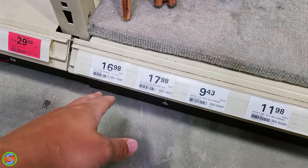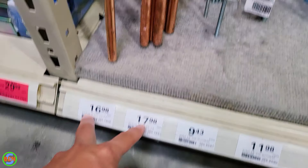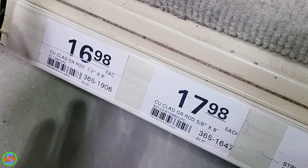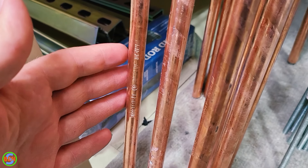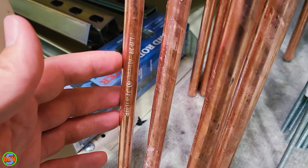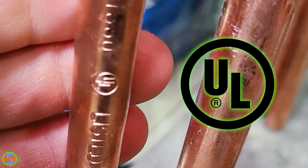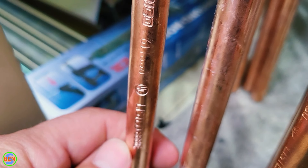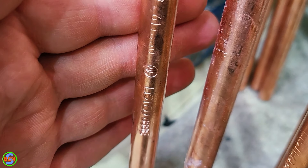The price is actually super similar — these two are only a dollar difference for the different diameters. Since the cost isn't that different, I would just go with the 5/8. Half inch ground rods are permitted so long as they are listed with Underwriters Laboratories or possibly other listing agencies, but this marking has to be visible if you're going to be using a half inch ground rod.